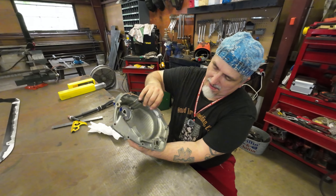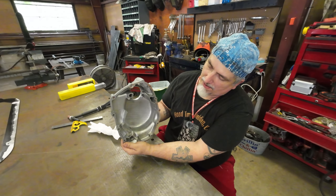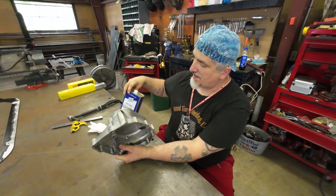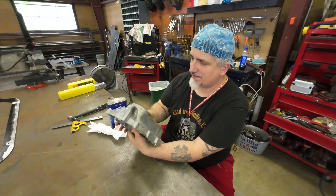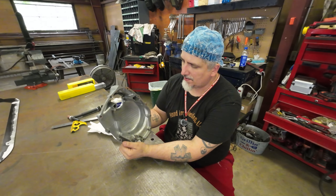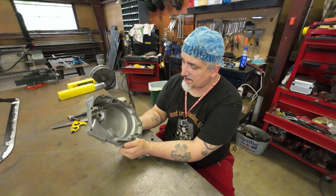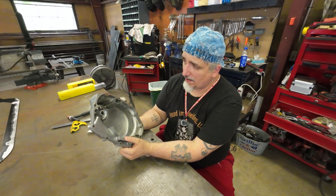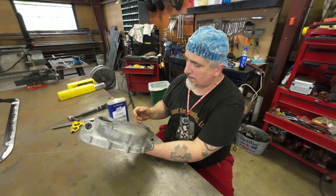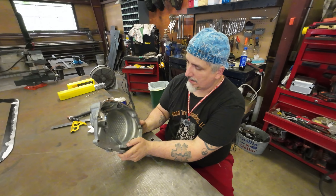What I'm going to do first is drill two holes at either end of the crack. The hole itself I'll need to build up and flush out. I have a stainless steel wire brush — I'm going to wire brush each spot, then use some acetone to clean it out a bit more. It's still real dirty. This is a 1980-something motorcycle and the customer is having a hard time getting parts for it anymore. It's not going to be the easiest repair because it's been impregnated with oil all these years, plus the regular casting problems you have with welding on cast to begin with. We'll wire brush it, clean it with acetone, get the holes drilled on the crack to keep it from spreading, and go from there.